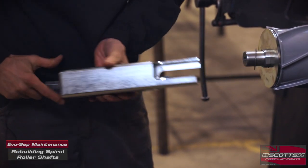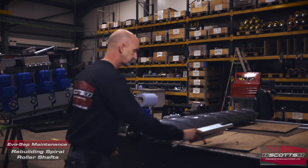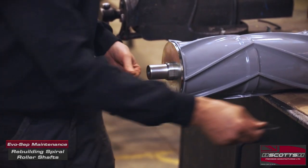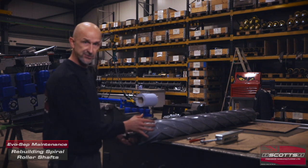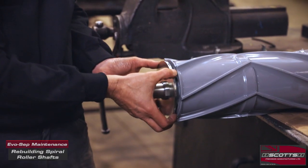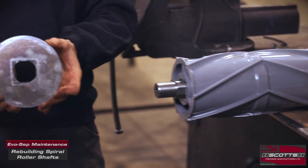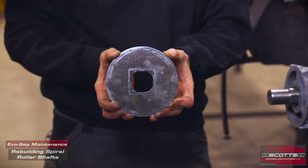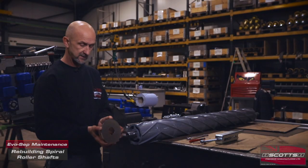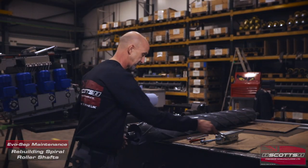Take the tool away from the shaft and screw it out of the end of the shaft. Now we can dismantle it. Circlip comes straight off — try not to stress those, try not to overbend them; if you do, always put a new one on. End disc, as you can see, it's quite an unusual shape in the center — half round, half square. The idea is it can slide up the shaft and it won't rotate.